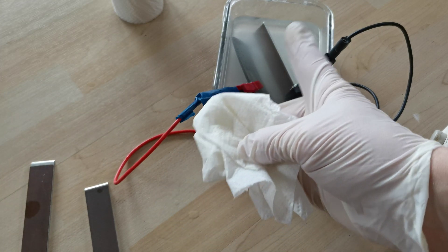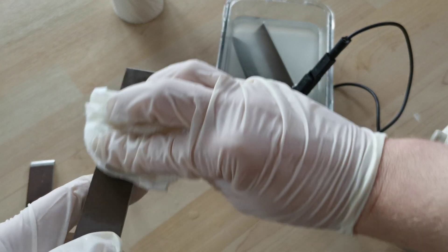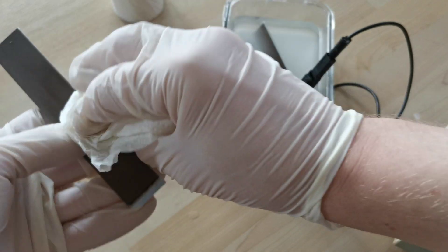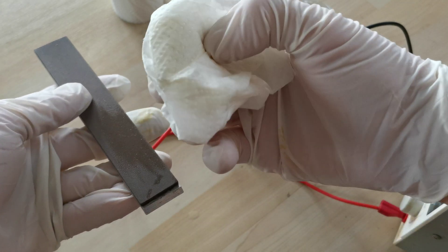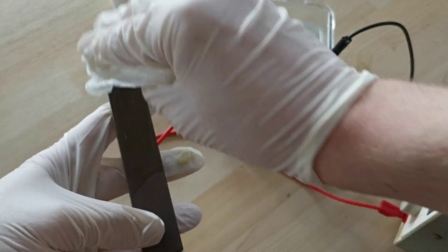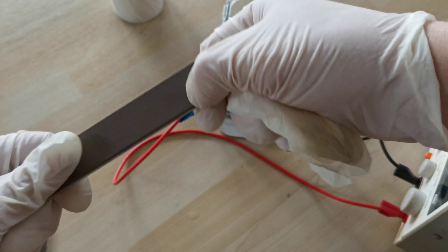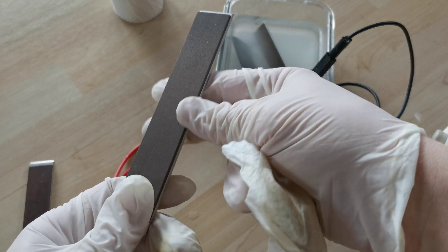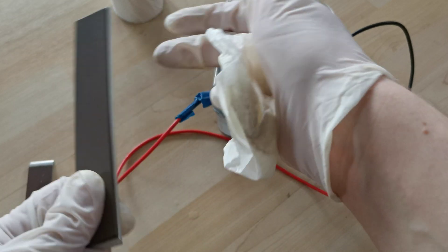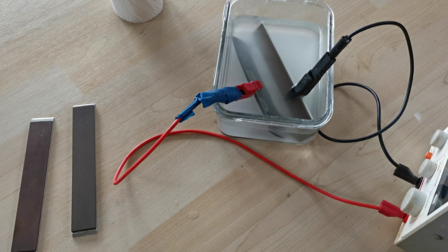Keep the bottle at a certain distance from the setup because there could always in theory be a spark, and you don't want that acetone to burst up in flames. I have already pre-cleaned this a little bit — there's not a lot coming off anymore, but a little bit. Brush and scrub off as much oil as you can and then this reaction will go very well. If it doesn't work for some reason, if you use oil, most likely there's still too much oil on there. It won't work very well with oil, or not at all, because again oil is an electrical insulator.